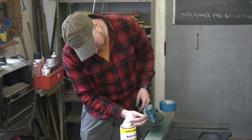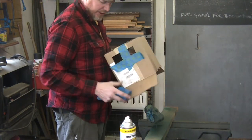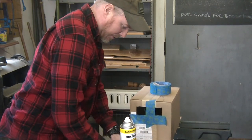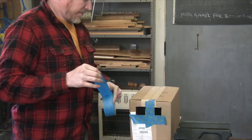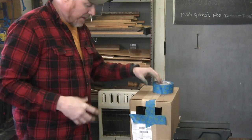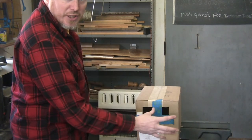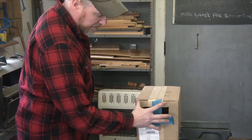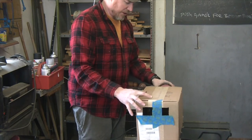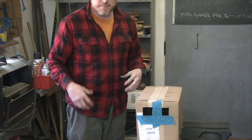We'll put the screws back in because they're painted as well, even though we'll never see them. I'm going to put my little easy-bake oven — a cardboard box — over the top. This is a really simple way to get paint to dry quickly. Cut a hole in the side so the heat can escape, put some tape over it to maintain a good temperature, then cut a circle in the back for the hair dryer. I like to position the hair dryer facing up so it washes around, put it on low, and let that go for about 10-15 minutes.